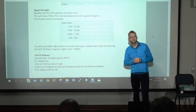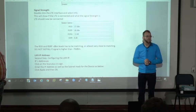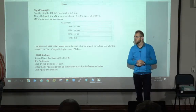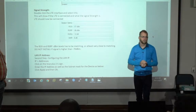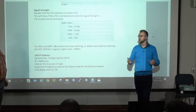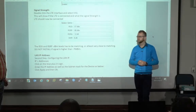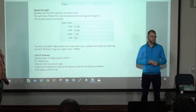Keep in mind, when you do test speech, once you've adjusted the signal, don't test with one phone call. Ask the client to at least make 4 concurrent calls. Because as soon as it's under load, that is where you're actually going to be picking it up. And don't make a 30-second call. Hold your call for a couple of minutes. Okay.